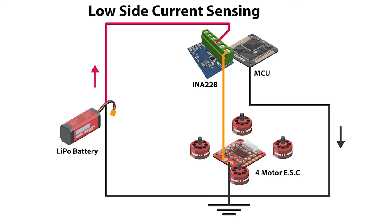In this configuration I have set this to low-side sensing, measuring the four motors and the ESC. If you put this in the high side, they don't share the same ground, so there are pros and cons to each measurement approach. We want to make sure they all have a common ground, so one of the grounds of the MCU — the Nordic Semi — is connected and they both share the same ground, so the reference of all of this will be the same.